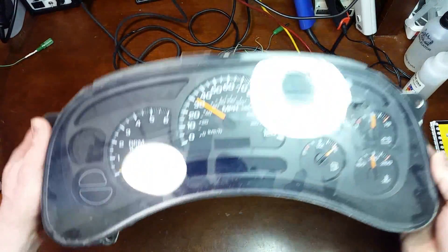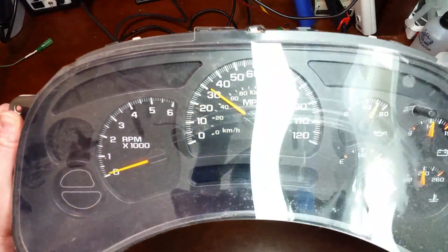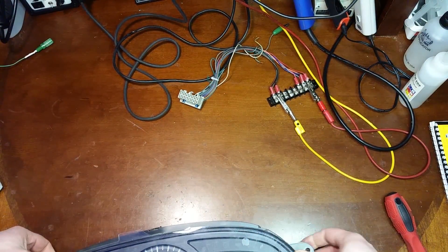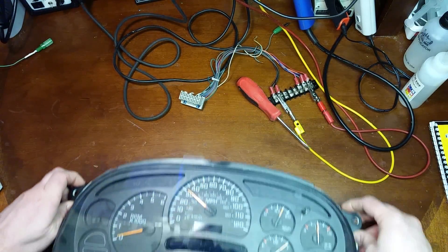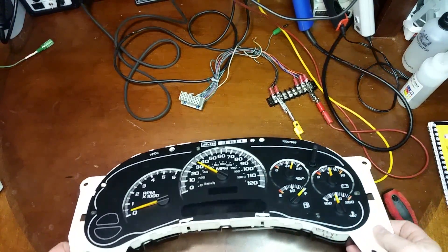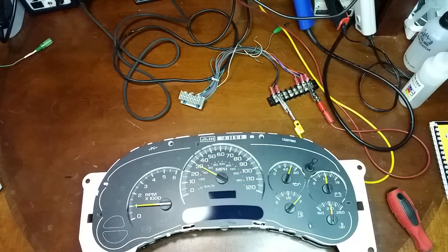I think this one's going to be interesting because when you look at the display film, it's got some scratches and nicks in there, which is always a good sign that somebody's been in there messing around. So it might be an interesting build. I can tell right away that all of the needles have been pushed down too far — they're actually bottoming out and rubbing. Kind of a rookie mistake; somebody was in there and really didn't know what they were doing.